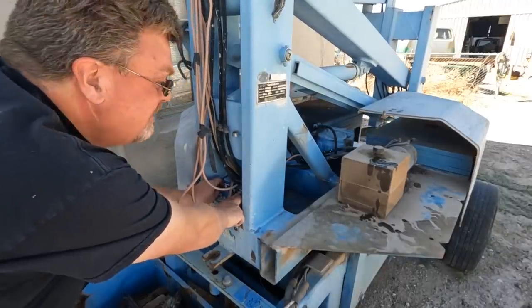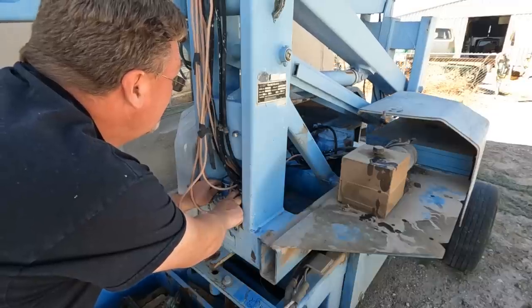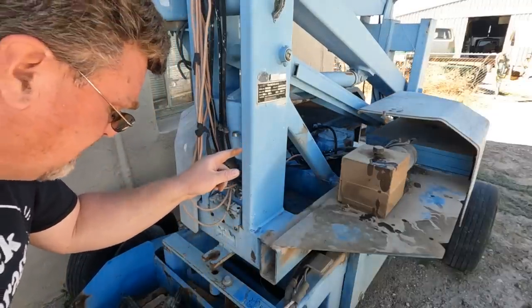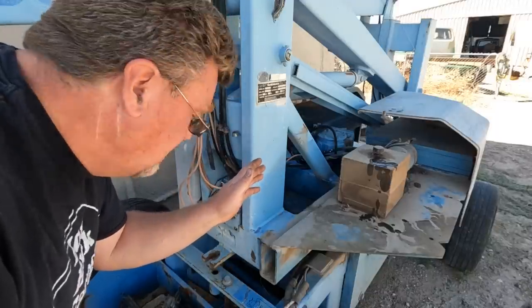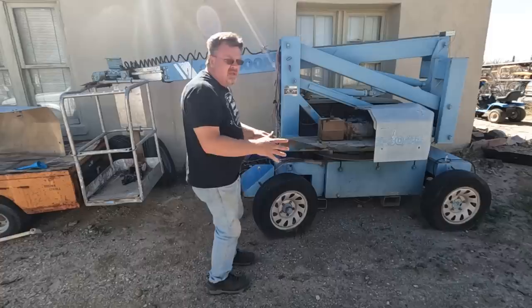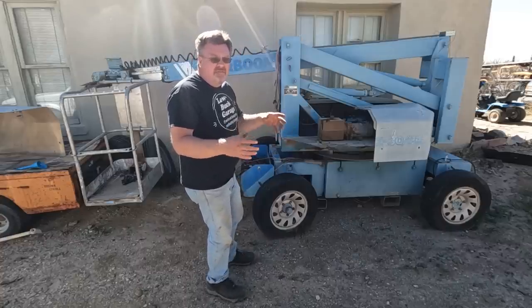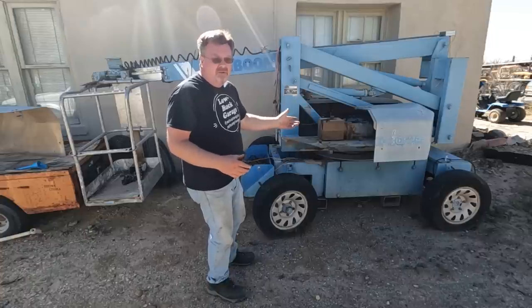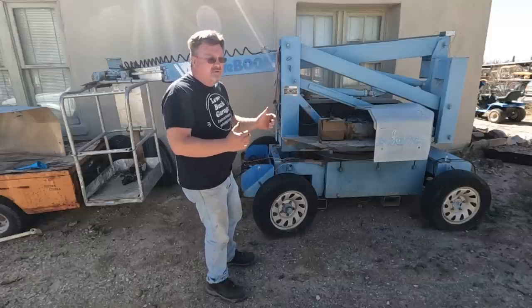It's lifting up — main pump's working, but that little pump isn't. So I'm going to set it off again because I know it wasn't supposed to run continuously; I don't want to burn anything out. I know that brake works automatically with the drive system. I'm wondering if maybe the drive needs to actuate in order for fluid to flow through it and that pump to build pressure. I'm not sure, but I don't see anything obvious that's the problem, so I'm going to try actually driving it.